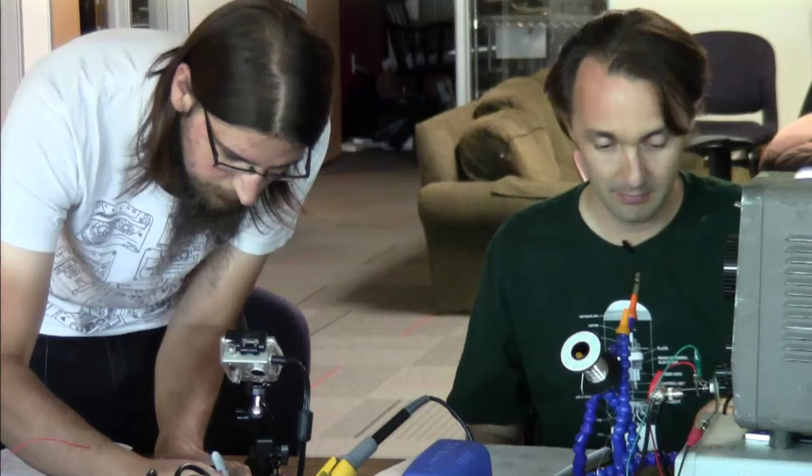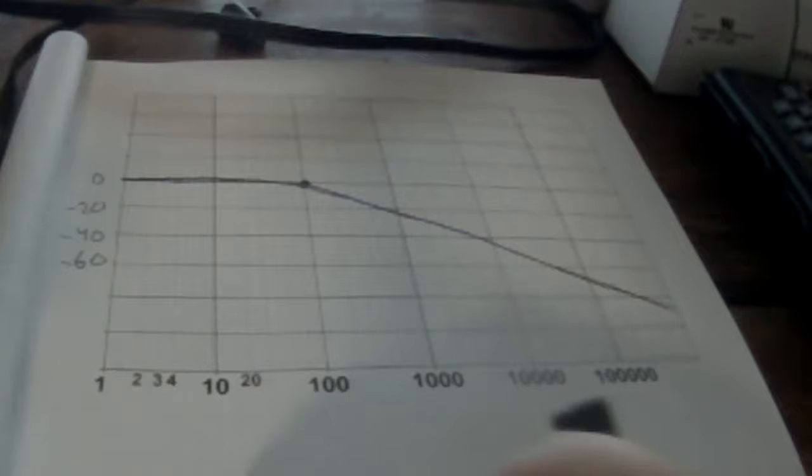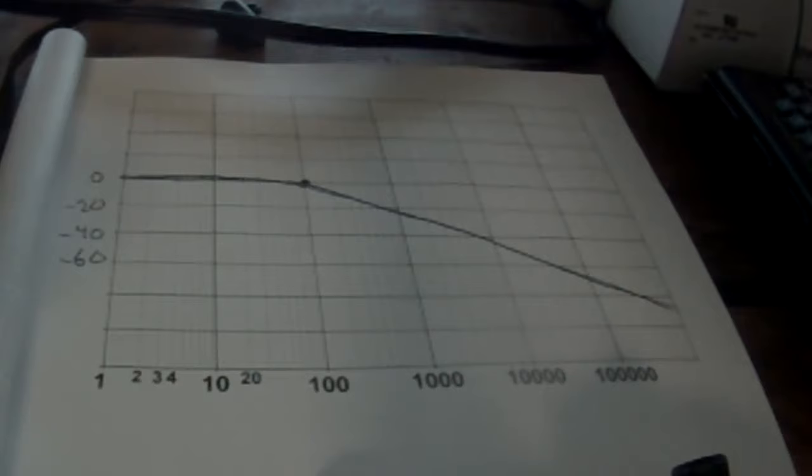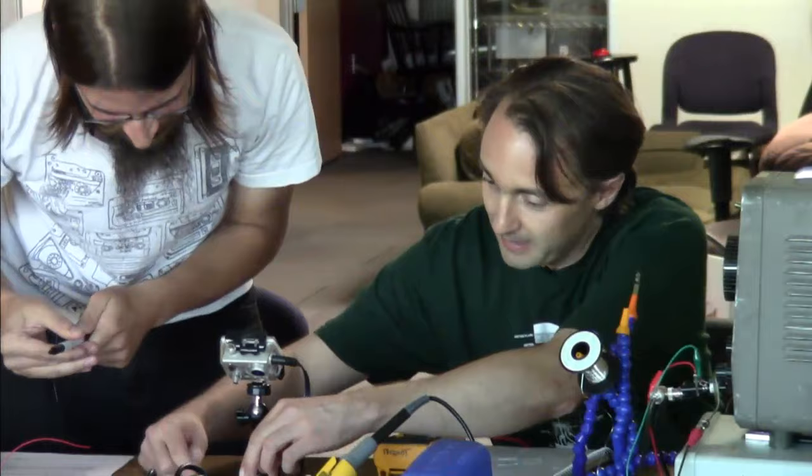If you wanted to make a very simple preamp, you could just move that knee down to the 20 hertz beginning and say, well, that's straight enough. But if we compare it to our other shape, it's much, much steeper as specified. So you put a couple of poles in there to push it down farther. In the middle of the S-shaped curve there's actually what's specified as a flat point, right here, above which it drops and below which it's boosted.